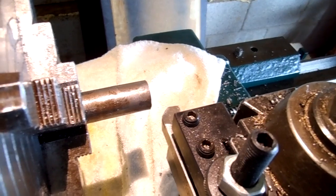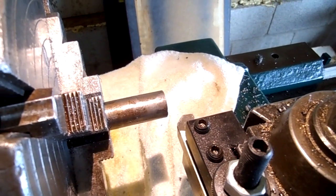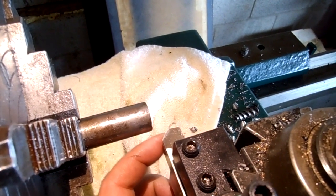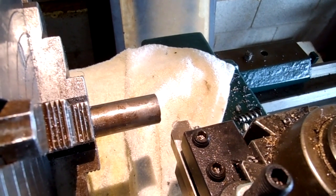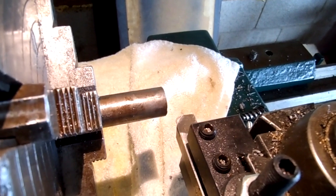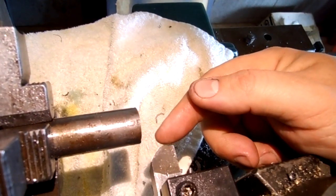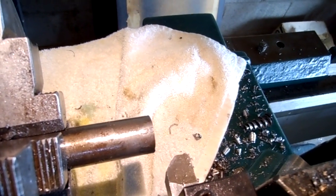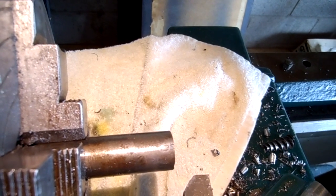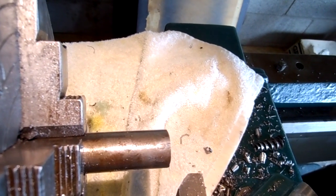The roughing part is at a 45 degree angle with about 8 to 10 degrees of side rake on top. The side cutting edge clearance is roughly 6 to 8 degrees. The finishing point is a 10 degree point, also at roughly 6 to 8 degrees of clearance, and then there's a negative 5 degree relief on the tool. It will take heavy cuts.